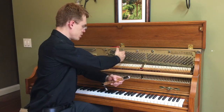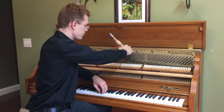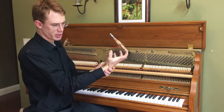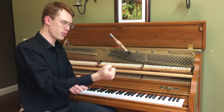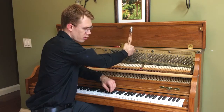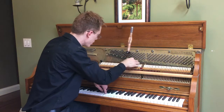When you do that with the impact hammer specifically, something that the hammer doesn't quite experience to any major degree, when I'm rotating and I have no escapement here, I'm aggressively participating in the impact. The brass weight here is extremely good at taking stress. These little muscles and tendons and joints in your hand, in your arm, and your elbow are not designed for that. They're designed for either rapid motion or gradual pushing or precision, but they're not designed for impact. And that's what you're experiencing when you do this. You're also, once again, losing your power and control at the same time. So this is a pure forearm rotation. There's our string.